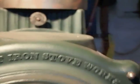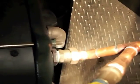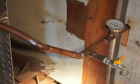We are heating the water inside the three-foot elm — wildfire elm — and there are two connections off the back of the stove. The cold water enters on this leg and the hot water leaves the stove at this connection. Here's a blow-off temperature pressure relief in case there should be steam in the system. The water comes in and it is heating a tank in the other room — this is the cold water in.